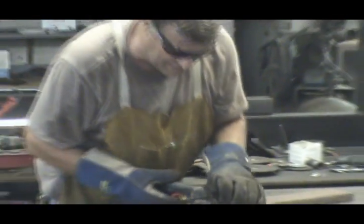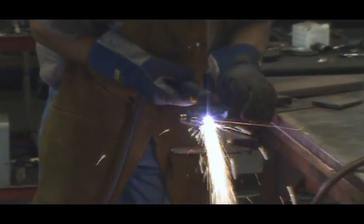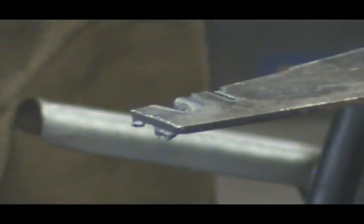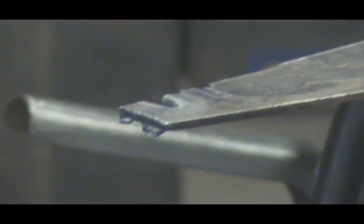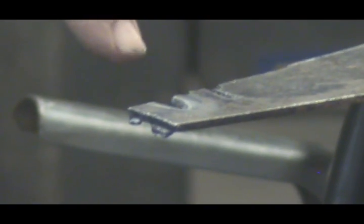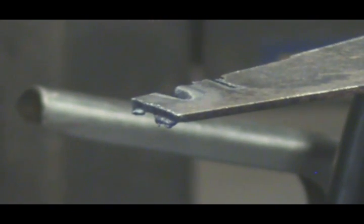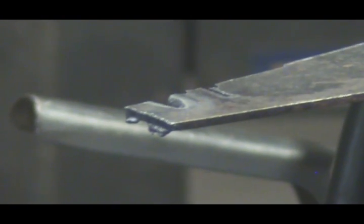Which cut is cleaner? Let me show you. That's why I made this little cut with the Oxygen Acetylene, so I'm going to make a little one with the Plasma Cutter. Take a look — see this? You can see this is the Oxygen Acetylene cut: how melted it is and kind of uneven on the edges. And you can see where the Plasma Cutter gives that nice, straight, even cut with nice square sides.